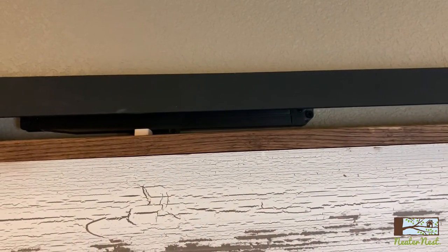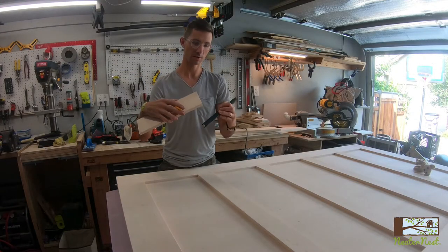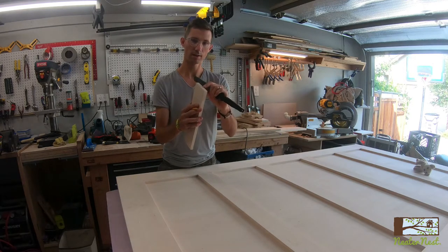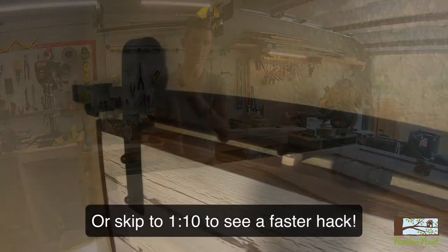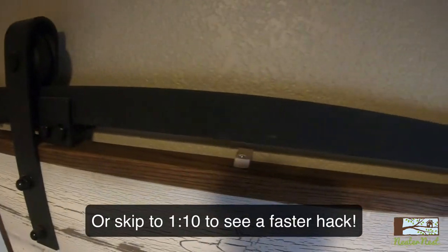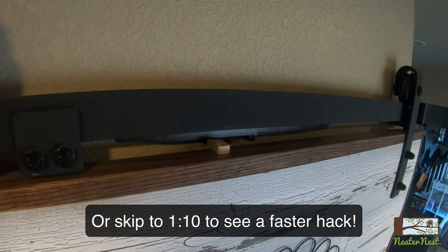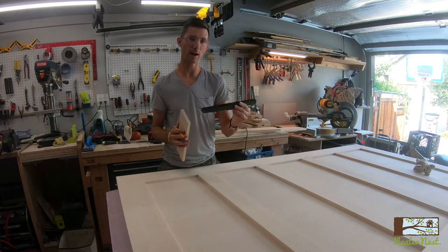The main problem is that there's not enough clearance between the Freedom Clamps and the top of the door. So we're going to make a piece of wood that's thin enough to go underneath the mounting brackets, but it will stick out behind the door enough to catch the soft close. And we're going to mount the soft close to the wall rather than mounting it to the track.